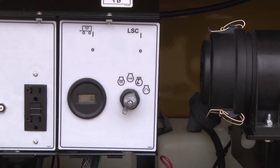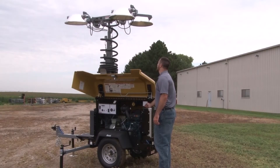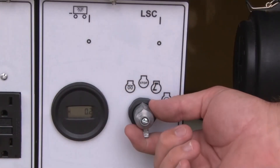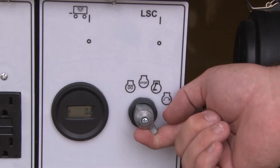At this time, on the control panel, turn the key or knob to the run position. Now we will use the hydraulic switch to check the light tower mast's telescoping system. Time to check the engine: turn the key to the counterclockwise direction for five seconds.